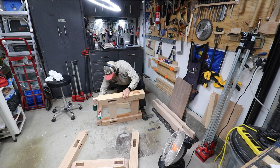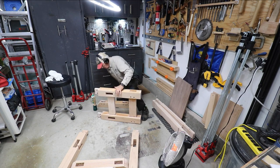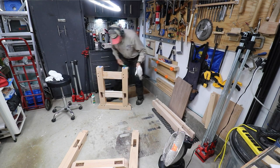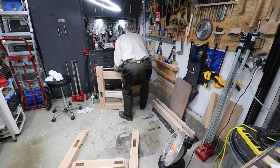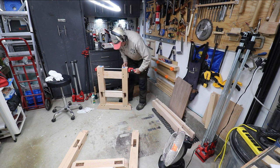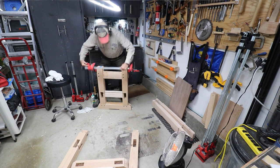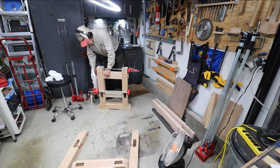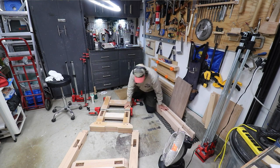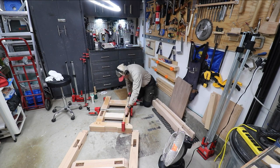In this video, I'm doing a glue-up of my Samurai Carpenter workbench base and it did not go as well as it was supposed to. There's a number of reasons for that — there's a few principles that you need to pay attention to. One of the first ones is if the dry fit doesn't go together really smoothly, then when you add glue to the arrangement, it's going to go even worse.